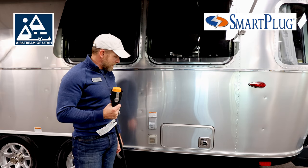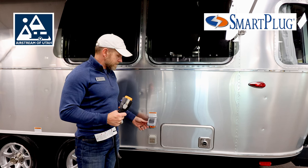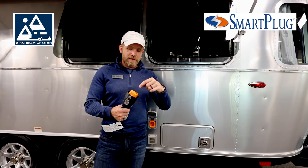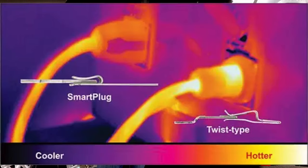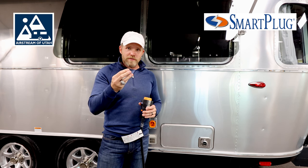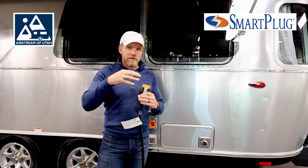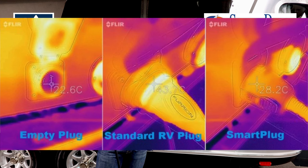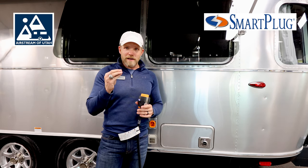Starting off here, you have a really nice connector on the outside. This is a 30-amp service, 125 volt. One cool thing about the smart plug itself is it has about 27 times more surface area contacted when the electrodes are put together. Compared to your old twist ones, the prongs, when you twisted it on, were what actually held it together — so there was some friction and very light touching, causing a lot of heat. Contrary to popular belief, most RV and marine fires start at this plug on the old style more than anything else, because it was an electrical failure.